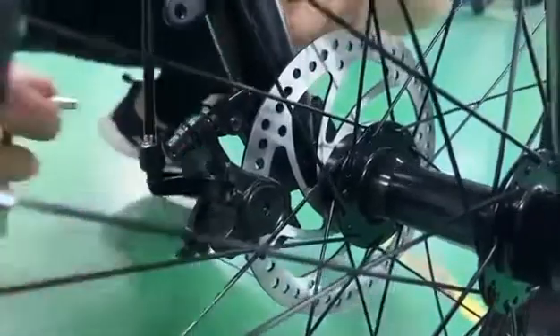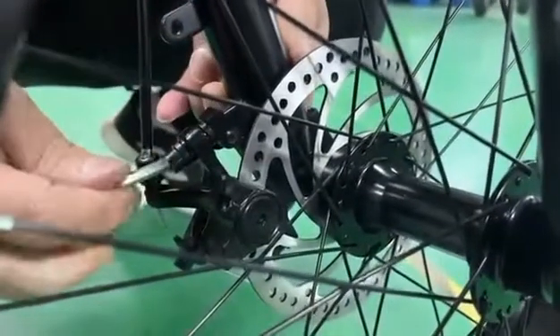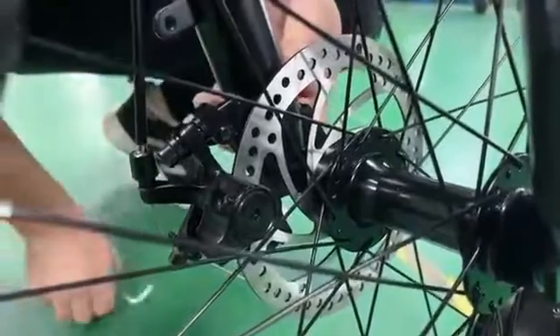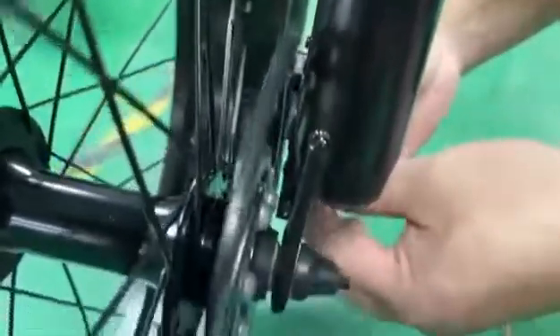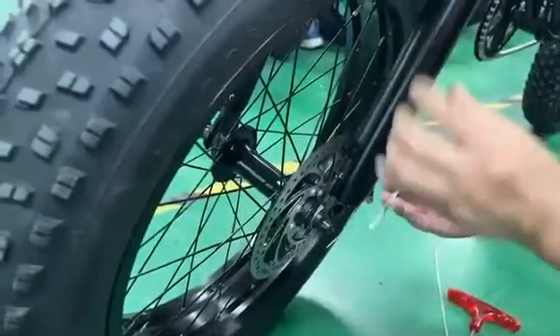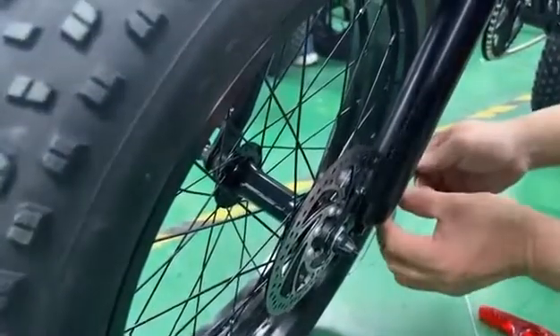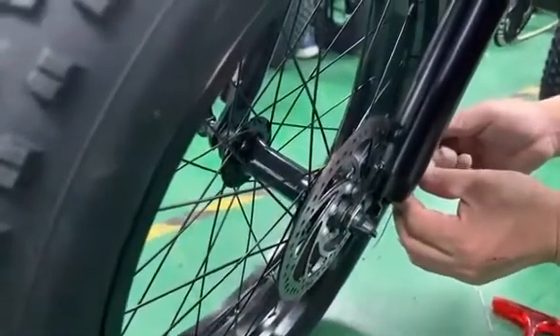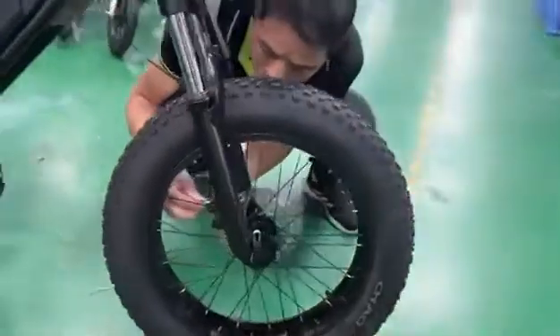The gap for each side should be the same. Check and make sure the pad is in the middle, then fasten the screws. The logic is: make sure the pad is in the middle. You can adjust the first screw or the last one — just make sure it's in the middle. You need to make a lot of adjustments to get it right — it's a kind of experience. Just try more times and you will become experts. Thanks!